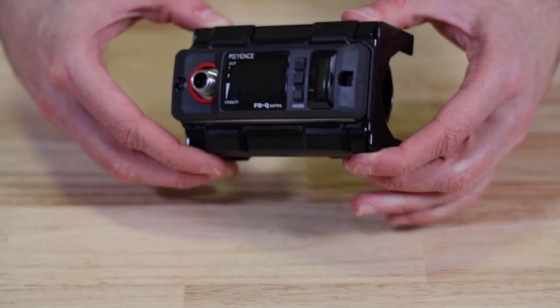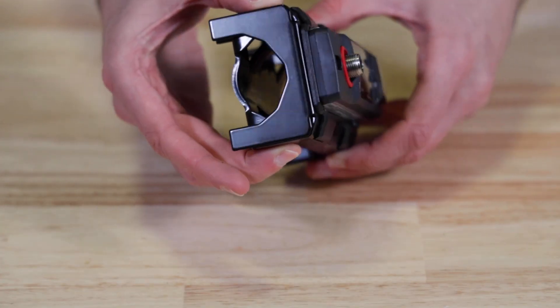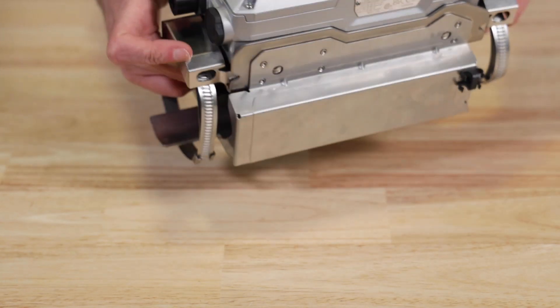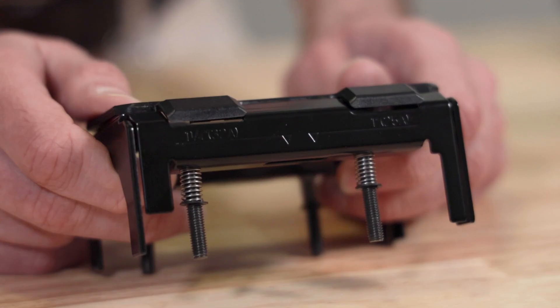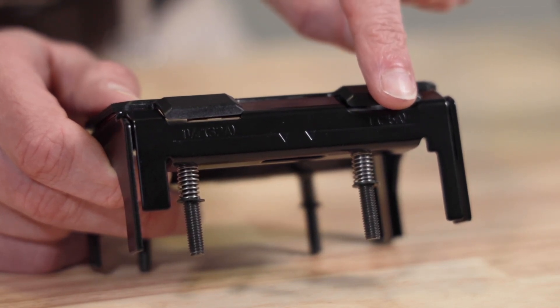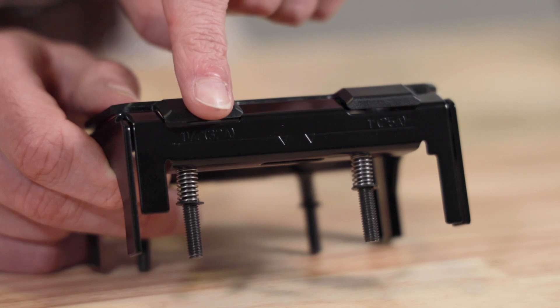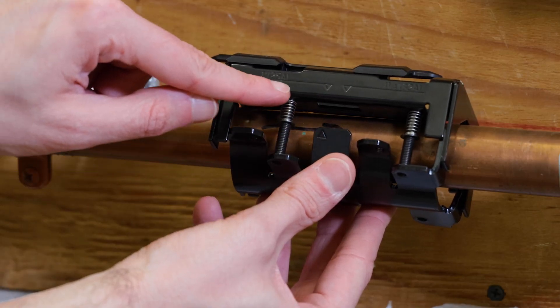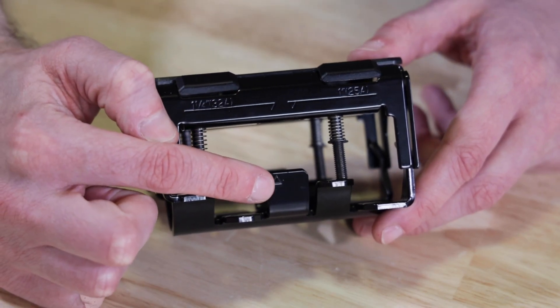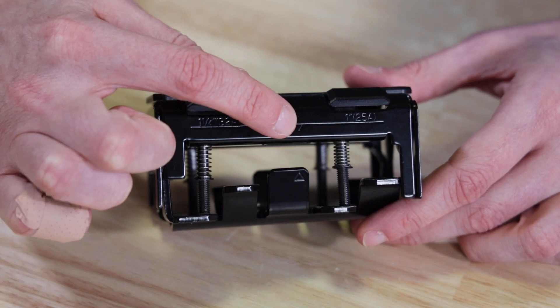For our next step, we'll mount the sensors. There are two different bracket types depending on the sensor type and pipe size. The smaller FDQ sensors use a bolt-on clamp bracket, and the larger FDR sensors use a bracket with stainless steel threaded straps, like a hose clamp. Let's mount one of the smaller FDQ sensors. The brackets are designed to be used on two different pipe sizes, which are stamped into the upper part of the bracket. For example, this bracket is used for one inch and inch and a quarter piping. Just line up the arrow on the bottom half of the bracket with the corresponding arrow on the top half of the bracket. If the arrow points to the incorrect pipe size, just flip the bottom bracket over to match the arrows to the correct size.